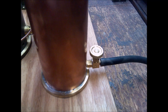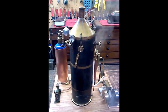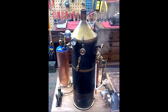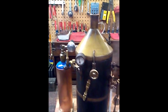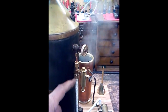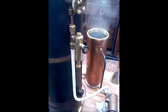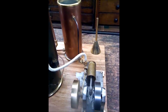That's the drain so you can empty the boiler at the end of the run. This is the drain for the collector, which we'll talk about. Here we are under steam — it took 12 minutes to raise steam from 60 degrees Fahrenheit to 30 pounds on the gauge. The oil injector is open; oil is being introduced into the steam line. You can see that I insulated the steam line to try to keep it a little warmer so there was less condensation.